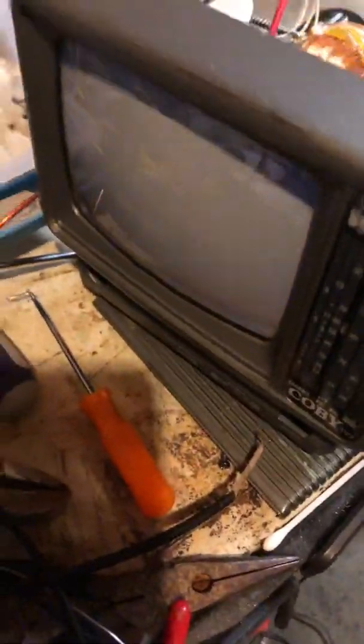With the separation of these wires, it's the same as a speaker setup - you have a left and ground, then a right and ground. I figured it out by setting the pins in and touching the speaker wires until I saw the little dot move. Let me plug this back in and turn it on to show you. Plugged in and turned on, it should just be playing static like a regular TV - and there it is. Now disconnect it and you get a dot.